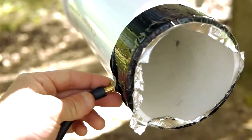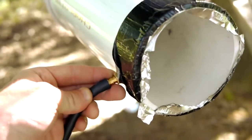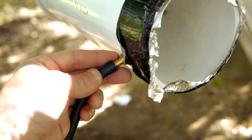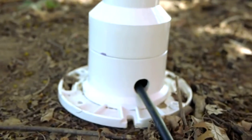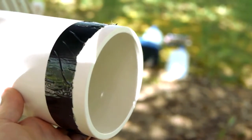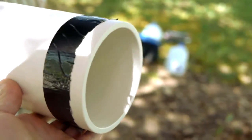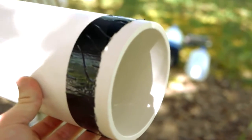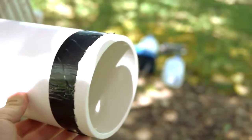The fitting here is just a quarter-inch to one-eighth threaded hose fitting, and this is just vacuum hose coming off of the vacuum pump, which I will show in another video. This end of the pipe is the same as the back half, except you only need the air hose fitting on one side because you can suck the air out of the full length of pipe from just one location.